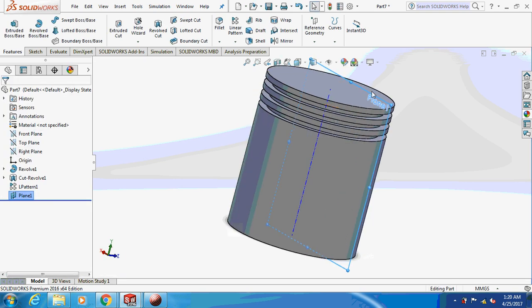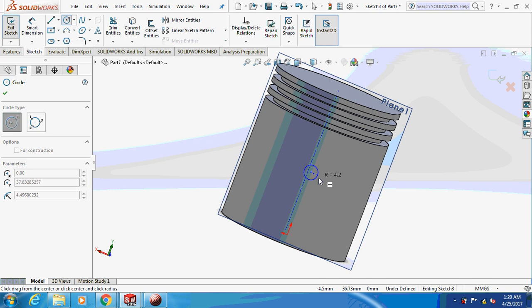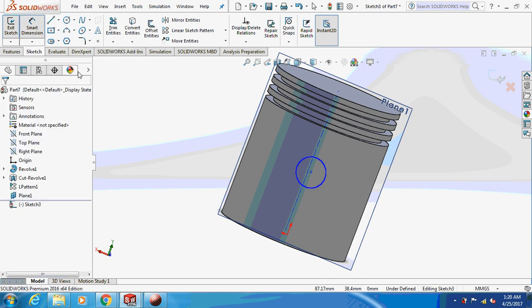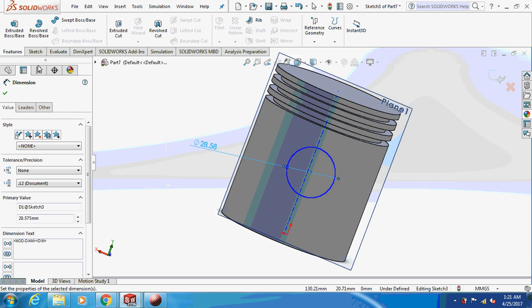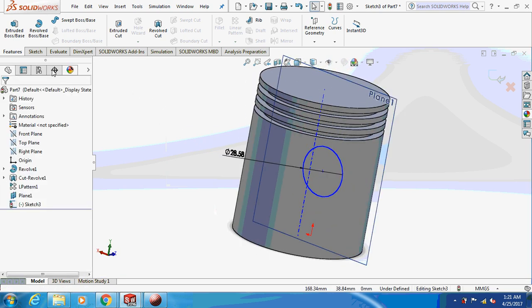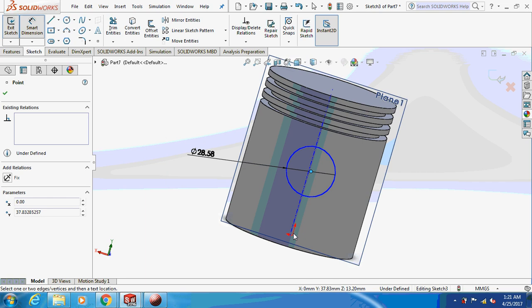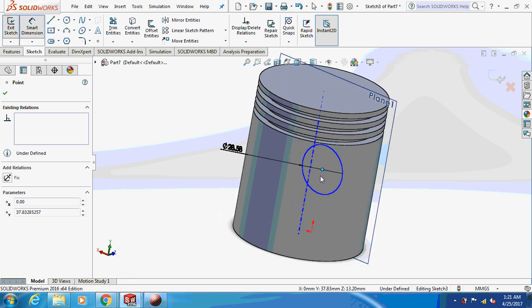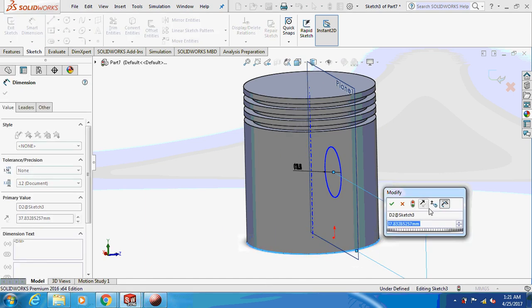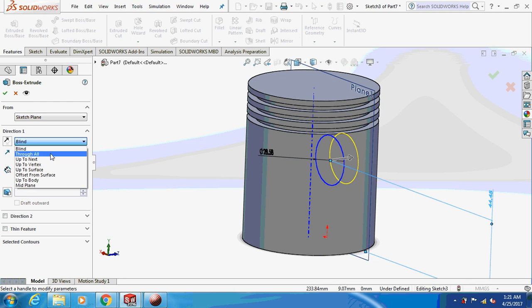With reference to the front plane, give another planar distance of 13.2 mm. Sketch on this plane and dimension it as 28.575 mm. Just extrude this thing up to the surface — give the horizontal dimension first: 44.45 mm. Go to Features > Extrude, extrude up to the next surface.